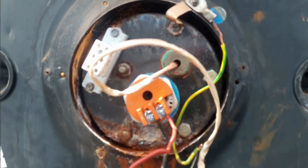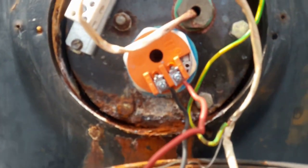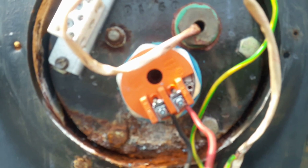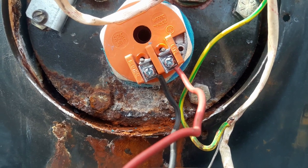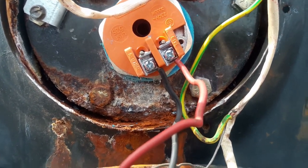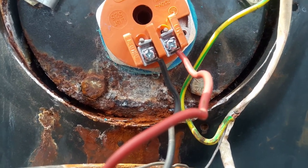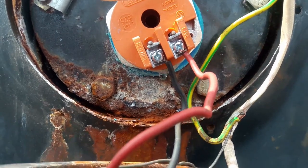This is how it looks when you have opened the cover — the wiring is exposed. The black and the red and the green wire are coming directly from your circuit breaker. If you haven't switched that off and you touch there, you're going to be shocked. And you can see right there under the black wire, there's a drop of water. Those wires are exposed to water. That orange thing you see over there is part of the element.